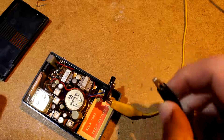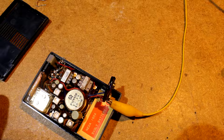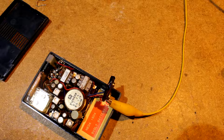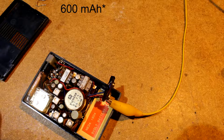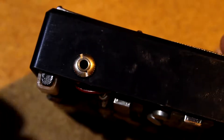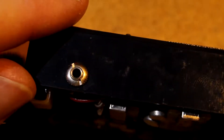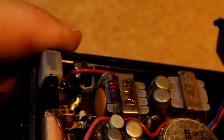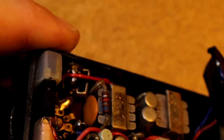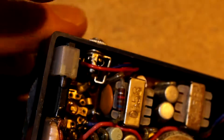While it's running it's topping out around 40–50 milliamps, so with a modern lithium-ion 9-volt battery at 600 milliamps, it's going to last a good 12 hours or so on a charge. Also worth noting — this is not the standard modern headphone jack. It's not a quarter inch or an eighth inch; it looks like the same TRS-style design but just the smaller one, not what we would normally associate with headphones today.